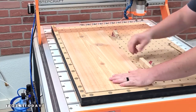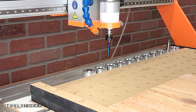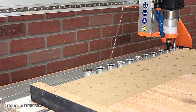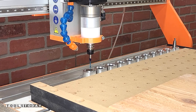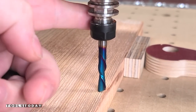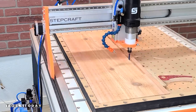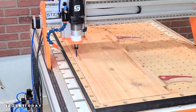The first panel is done, and I'll put down another piece of wood to use for the back panel. I wanted to show you how the auto tool changer works. First we need to go through and set the offsets — it's measuring the length of each bit and calculating the difference between them. We'll switch back to the first bit and measure off the material to set our Z zero position. Now that it knows where the material is, it knows the difference between the two, so we're able to switch back and forth between the tools without issue.